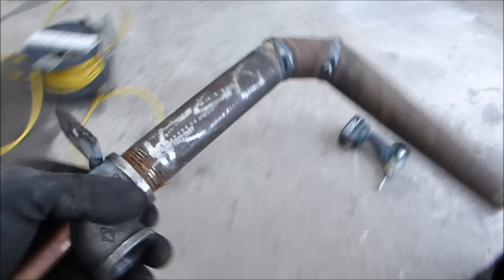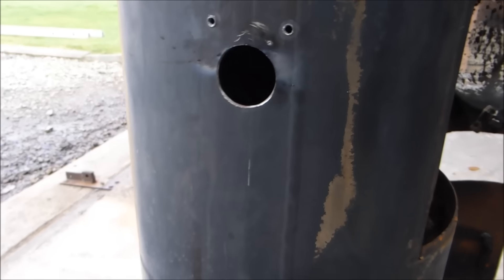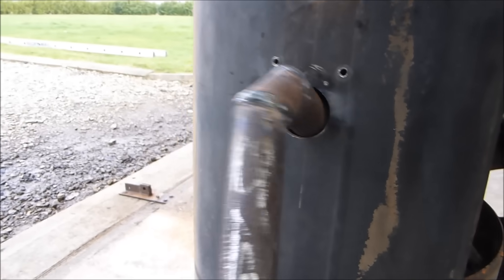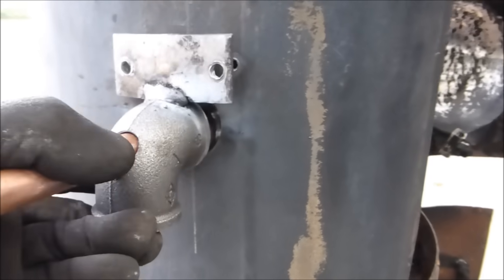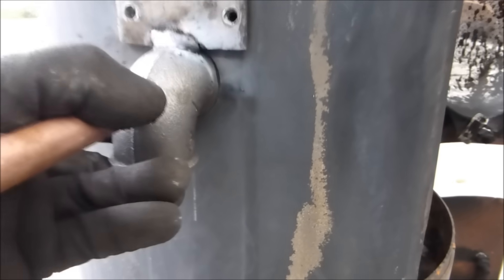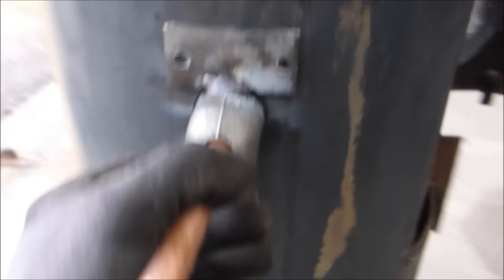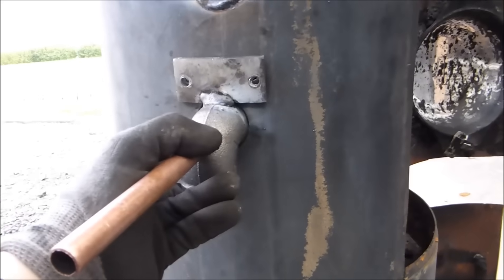What I'll do is mock it up now so that you can see what's going on. So there's the half inch pipe in the center of that one inch pipe — there's the whole burner unit, which is no more than just a bit of pipe with a bend on it. I've already drilled a 44mm hole in this thing. This thing goes through it, and you can see the fit — it's a nice tight fit all the way around, no gap. It wouldn't matter anyway if it was a little bit sloppy, because air would just end up being sucked in by the fire.